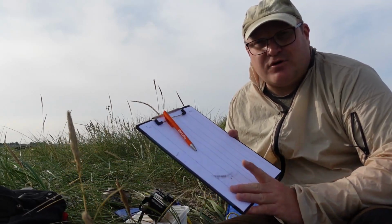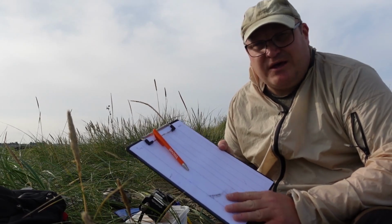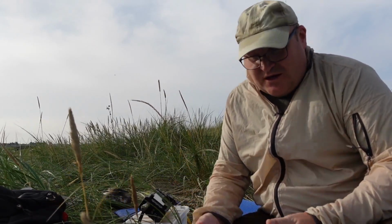You're also not locked to running only one class, which means that you can run like one QSO at 0.9 watts and the next one at 4.9 watts, and you can then log. And that's the reason I'm actually logging by paper. It's the only place you will see me log anything by paper if I don't have an electronic option. I'm filling it in electronically later, but it's so much easier on paper. Also, you can usually start off at 0.9 watts, see if the other guy's hearing you, and then go back to class 3 if he doesn't hear you, and see if that works. And I can actually go up to class 2 here, up to 10 watts with this radio. So yeah, it's worth a try at least.